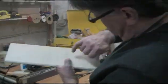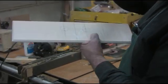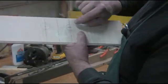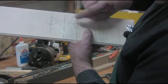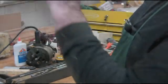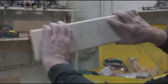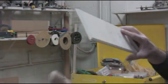You can go in here and, if you got a little short finishing nail, drill your little teeny hole, top, bottom, just enough that the nail will stick in. So when you get it up on the case, you can take a hammer and tap them in. And that's going to keep this drawer from moving around, because we're going to have glue on the back of that drawer and it's going to try to scoot you around.